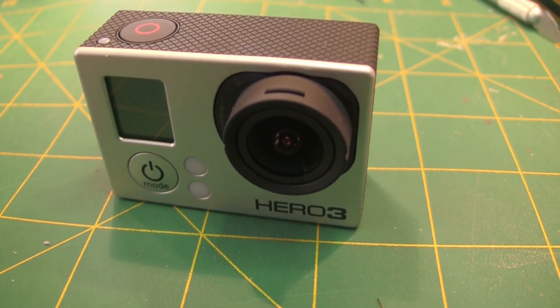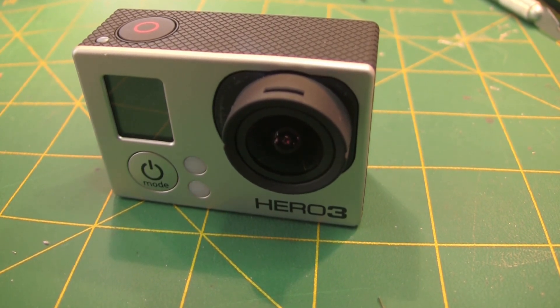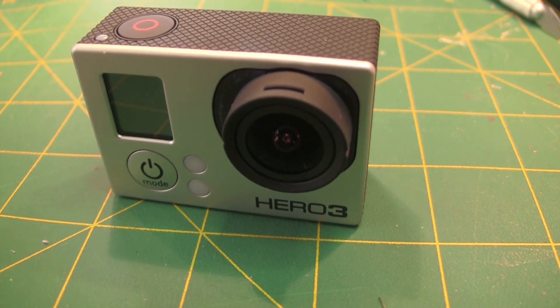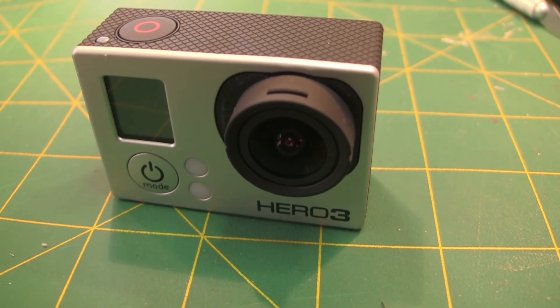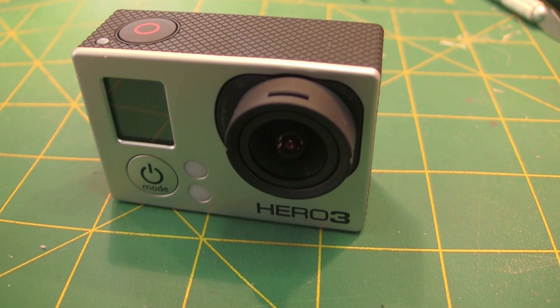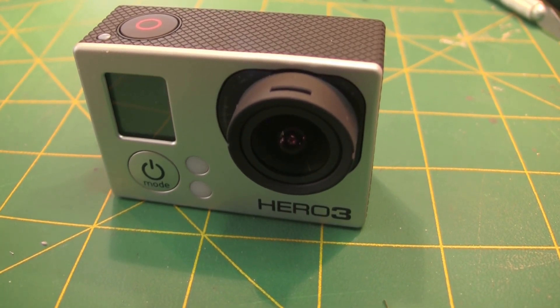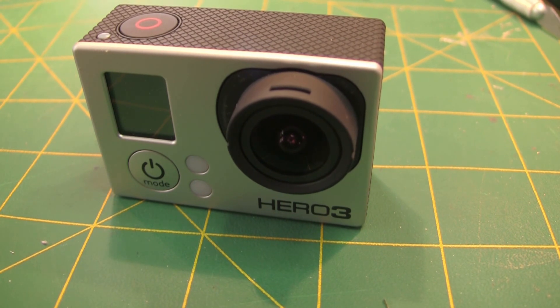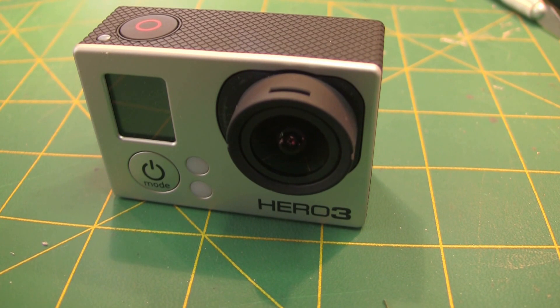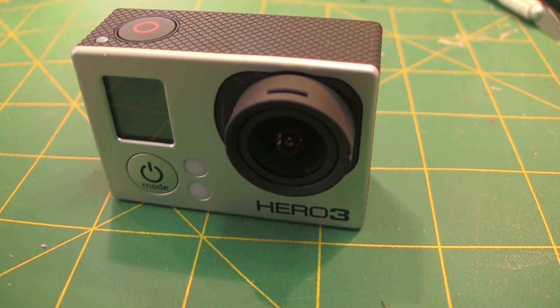I'd seen on some YouTube posts that people brought their camera close to the GPS antenna and it started flashing red and doing all sorts of weird things, not locking in. So it does seem to be a problem with this camera — it is quite RF noisy. Lots of interference from it, and that's with the Wi-Fi turned off. Having the Wi-Fi turned on definitely interferes, there's no question. I was having issues on a windy day trying to take photos and it kept drifting all over the place.